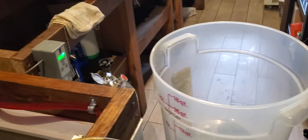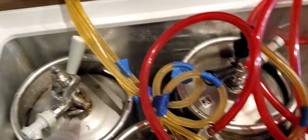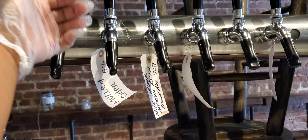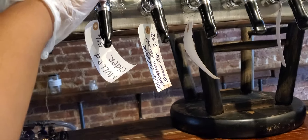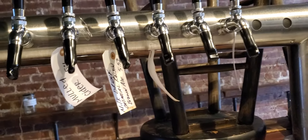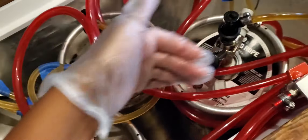I want to point out one more time why it's important that we disengage the kegs. There can be a mistake where you pull a line — say this keg is all the way over here and it was attached to four — so you could say to yourself, 'I pulled off the first keg,' and then you open this and start pulling the first tap line, and that's going to get you in trouble because now you're pouring beer, not cleaner. That's why you want to disengage everything inside, so that no matter what handle you pull, you're not pulling beer.